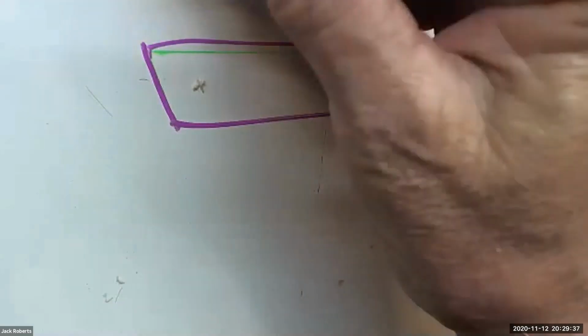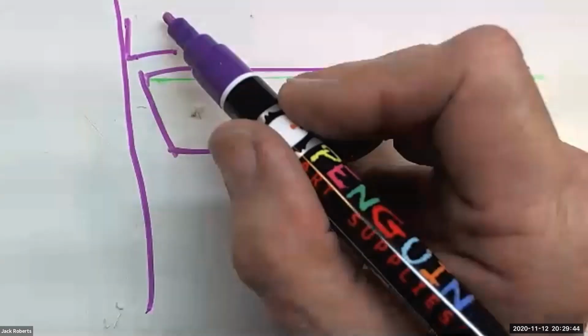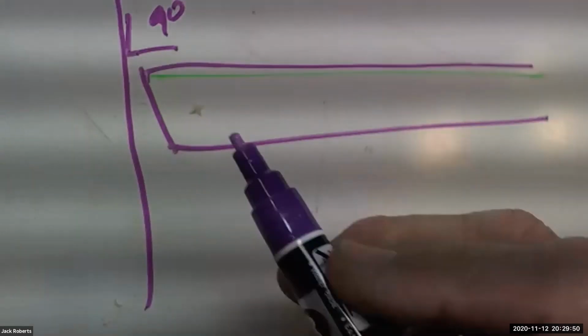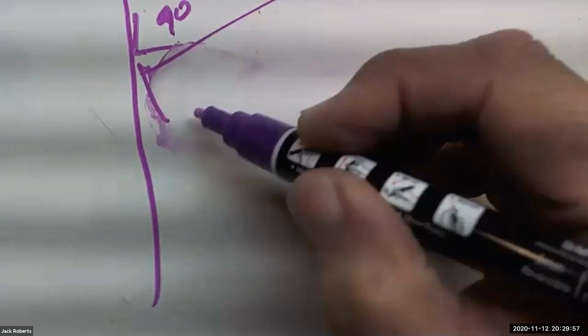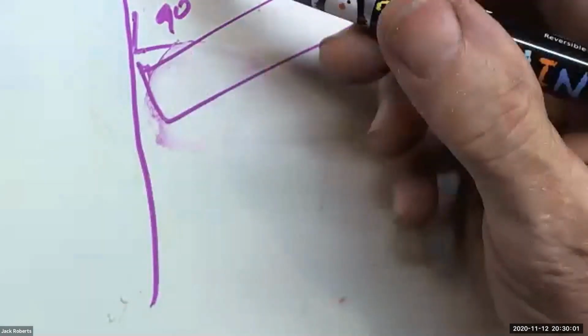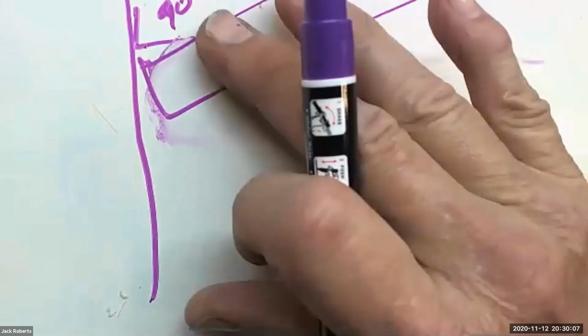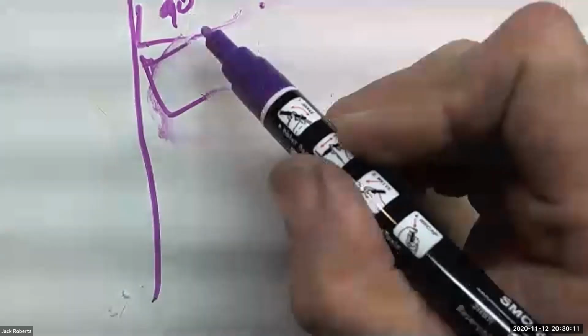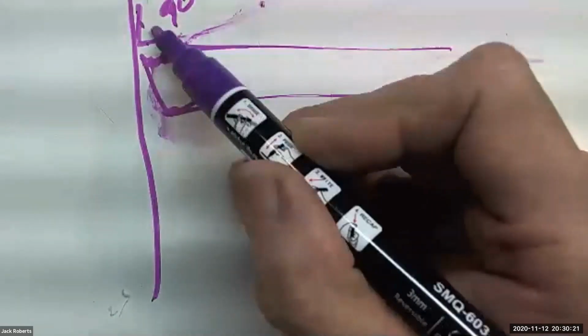As long as this piece of wood right here is 90 degrees here or less, you can't get a catch with this tool. So what we've done to make sure that happens is we raise this tool up back here so that it's like this. Now we're less than 90 degrees here, so that tool's safe. Everybody see that? What we've done with a negative rake scraper is we've just come back here and we've made the tool like that. That's all we've done. That's now the top of the tool, but we're able to hold it level because this is now less than 90 degrees from here to here. Everybody follow me? That's all a negative rake scraper is.